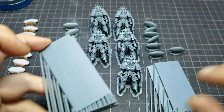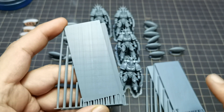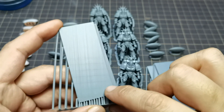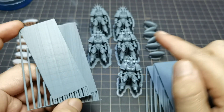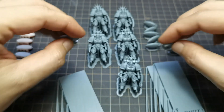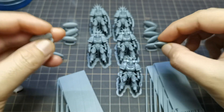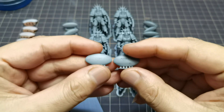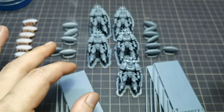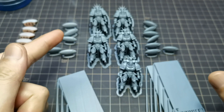My final conclusion: for the stability torture test, I assume that since I have owned the Anycubic Mono X longer, my guide block may be starting to wear out. If you own a new Anycubic Mono X and want to print these tests, I will provide a download link for the models. For anti-aliasing, obviously Mighty 4K has a very functional anti-aliasing compared to Mono X, and I hope future updates bring better anti-aliasing to Mono X. So which one is the best printer for you? I'll let you be the judge. That's all for today — thank you for watching, don't forget to subscribe, like, and share!